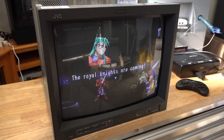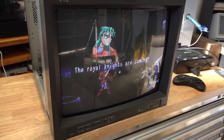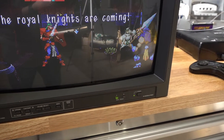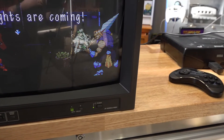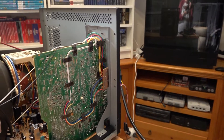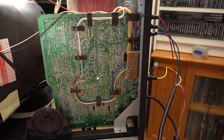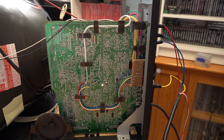So now we're just going to take a quick walk around the TV to get familiar with it. As you can see, I've got Guardian Heroes on the Saturn playing there. I apologise for that little flicker — I just can't quite get my camera to sync into the 60Hz. There we've got the front buttons down the bottom: chroma, contrast, volume up and down, menu and underscan. We've also got an A and B select, input select, and a power button. Just coming around to the side — the way these PVMs or pro video monitors were designed is great, much easier to modify than a standard consumer CRT. The boards are all split up and really easy to access. This is the main board we'll be concentrating on — this is where the modification gets done and where the jungle is located. Also got a mono speaker there for the unit.